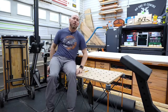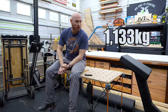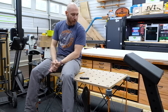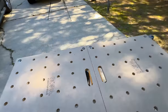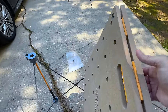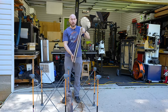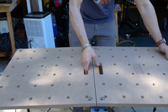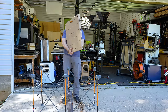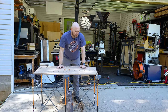Another great thing about the Bora is that it holds 2,500 pounds — that's 1,133 kilograms. This is one of the strongest mobile portable workbenches I've seen on the market. I'm 200 pounds moving around on it and it's barely moving — very stable workbench. One complaint I will have on the Bora is the top when you go to put it on. It is a finger-getter; this could seriously injure you if you don't put the top on right, because of the way it unfolds and folds back flat. There's a serious pinch point, and it pinched my fingers twice. You have to open it up from way out at the edges, and you don't want to do it too harshly because it is MDF.